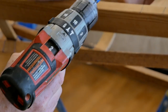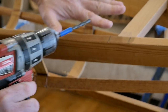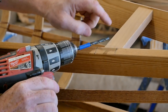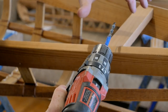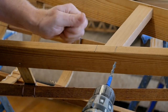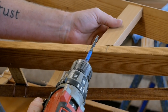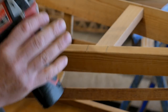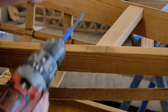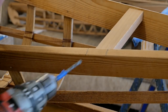I'm going to put the deck beam in place. One of the more frustrating things about doweled joinery like this is there's no real good way to hang on to it while you drill the first hole, and oftentimes as soon as the drill bit drills through it ends up moving the deck beam a little bit, which is not what you want. That's something you kind of get used to if you do enough of this, but it can be a little bit irritating when you're first getting started.